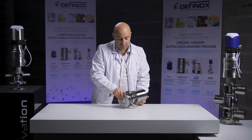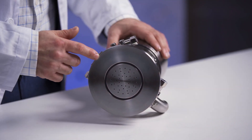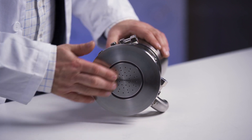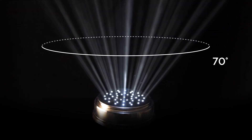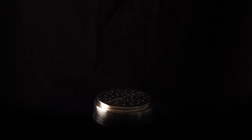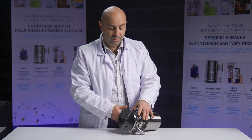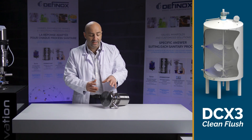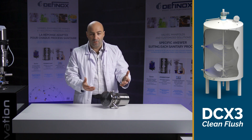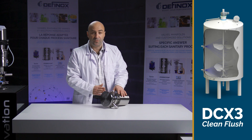On the underside we can see the flange with 360° rotation, so the valve can rotate around. We have a spray plate that is totally flat, and the most interesting part is the pattern. The pattern allows coverage of a 70-degree angle from the middle axis, so it covers a wide range and we spray a CIP agent over a large surface from this point. With this angle, we do not need to tilt the valve to reach the expected target points, and the valve will always remain flush — fully compatible with an agitator in scraping wall mode without interference.